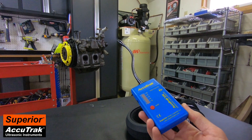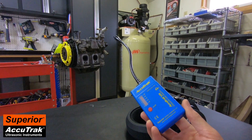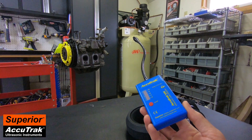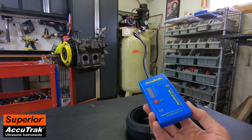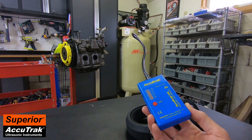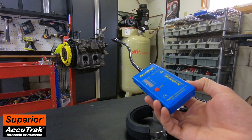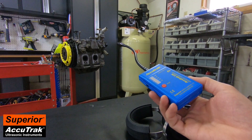This was great for that application — quick and easy. There are a lot of different ways I can use this instrument here in the shop; we'll definitely make some more videos showing those other applications. AccuTrack makes a variety of different ultrasonic leak detectors — some are higher-end, made for industrial environments for finding very small compressed gas leaks. But the VPE and the VPEGN are particularly suitable for hobbyists, automotive people, and HVAC technicians. As you can see, I definitely need to work on my pipe fitting skills.